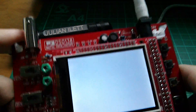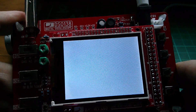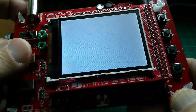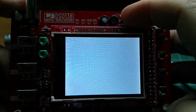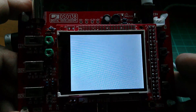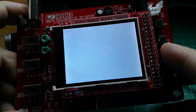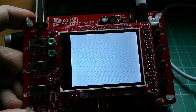So it leaves me with a question: regarding this display which worked for a couple of minutes — did it just die, or did I kill it? And why is the microcontroller not producing the VGen waveform to generate the negative analog voltage, even though it goes through the motions of running and produces the 1 kHz test signal? I'm going to see if I can get a new display. If that doesn't work, Banggood may send me a whole new oscilloscope and I'll have to go through the two-and-a-half-hour build all over again. It's a fail — unfortunately my oscilloscope doesn't work. Cheerio.